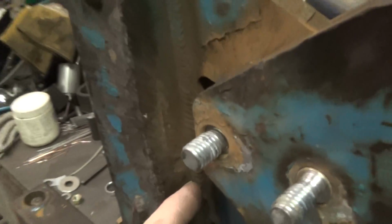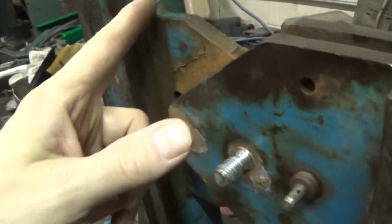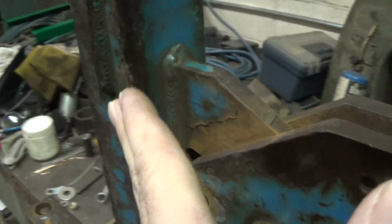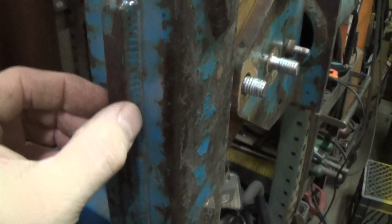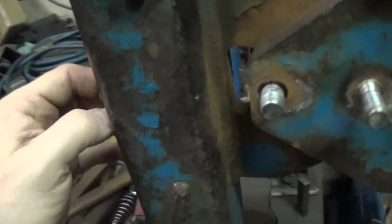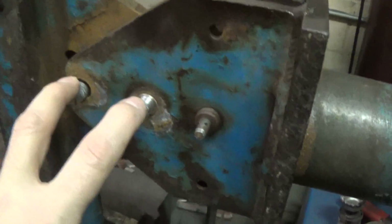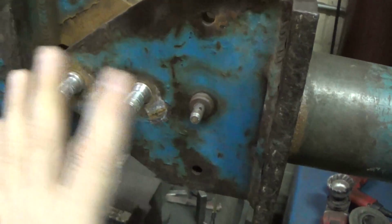Now this is a pretty well made thing. If you're looking at this, you can see this thing is very well constructed. Again, I guess they're pulling multi-million-dollar aircraft. You can see the workmanship that goes in. This attachment plate here is actually pierced through this thing, comes out this side, and it's welded continuously here and here, all around. And then it has these two bolts that hold it.